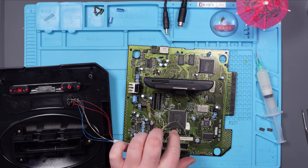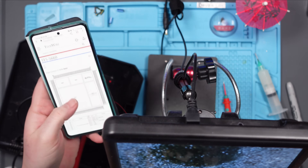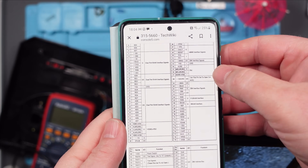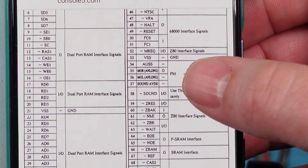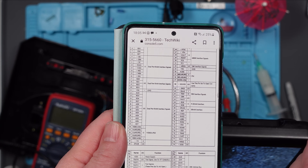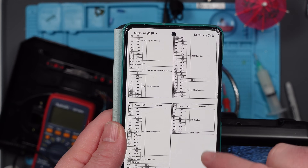I'm going to take a punt that it's going to come from maybe this main ASIC. It's going to be integrated somewhere but I just don't know where. Many hours have passed. We're looking at the pin out for the main ASIC, the 3155660 chip, which is this bad boy right here. And this section here is sound - we've got pins 55, 56 and 57, left and right analogue, etc. I've checked on the board and those are going where they need to go. I've checked the capacitors, I've checked various things. Everything seems fine but I have found something - I'll cut to the chase.